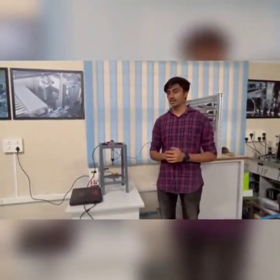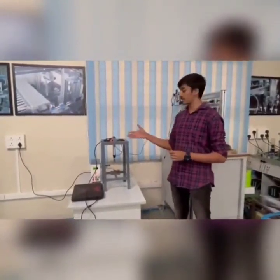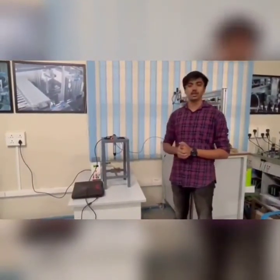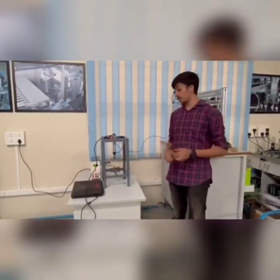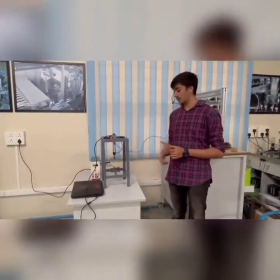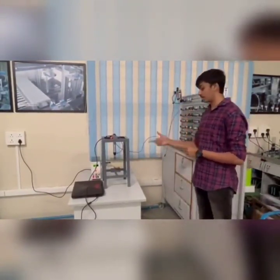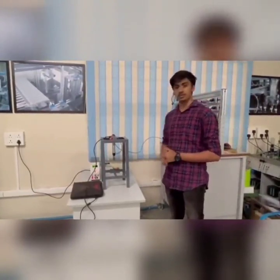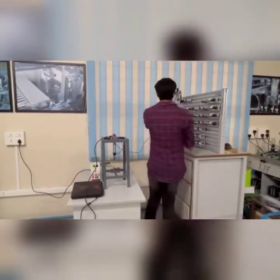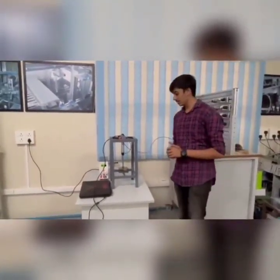It utilizes a cylinder that is in turn connected to a solenoid, which is actuated using the Arduino. So the Arduino runs a code with a delay, which is done in order to keep an object under the cylinder. And once the solenoid turns on, the pneumatic cylinder pushes down the punch, and the punching process is done. So this is the working of our project.